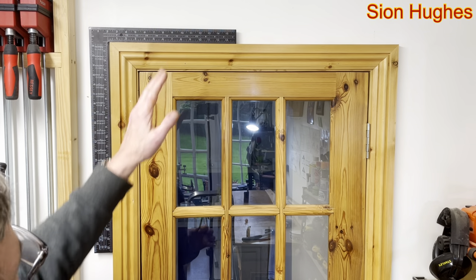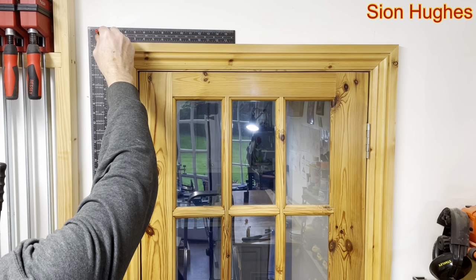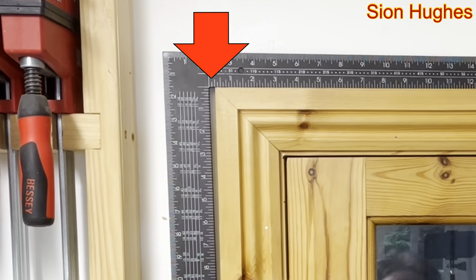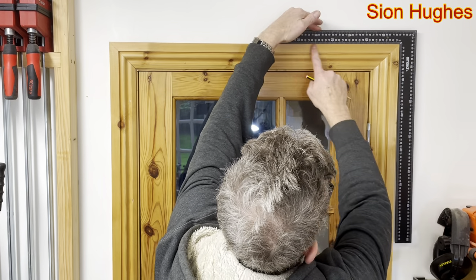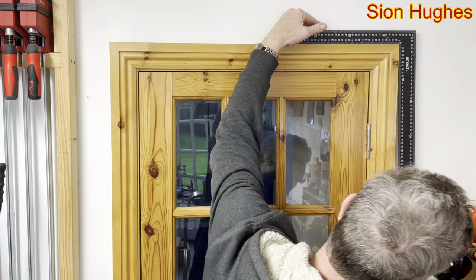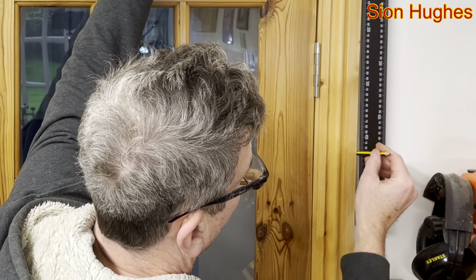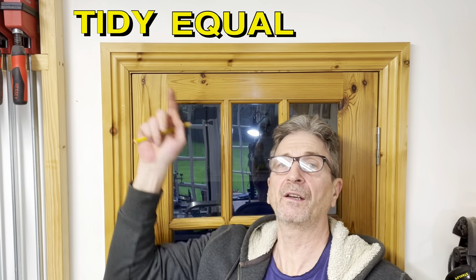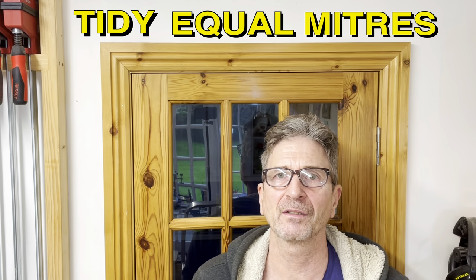You can now see as I put this square up here, I've got this touching at the bottom and I can actually fit the pencil pretty much in there, but I can't down there because the frame is leaning over that way. Using this as a reference right into the corner, the pencil is fitting in there and goes all the way up to that point. So the whole frame is a parallelogram leaning over like that — that's how I've managed to resolve this problem and get these clean-looking 45s on either side with a door frame that's completely leaning over to one side. I hope you found this useful, thanks for watching.